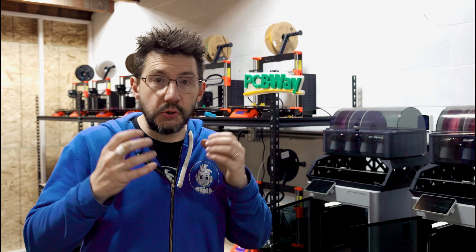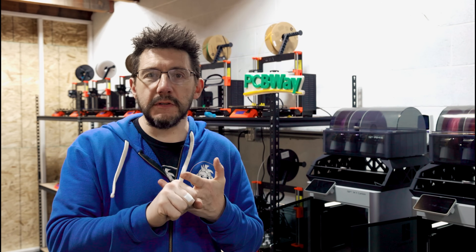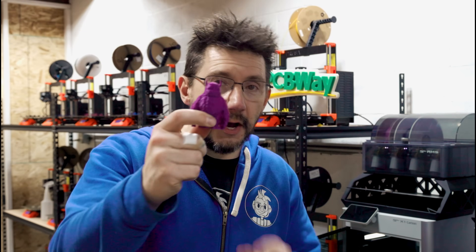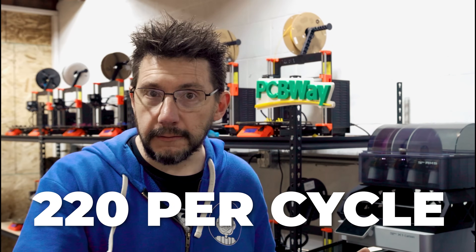We have everything we need to start the printing process. What we need to do now is clear off the 3D printers and get them ready — that means setting build plates properly, getting any support materials or purge lines off, wiping them down with isopropyl alcohol, preheating the hot end, and making sure the filament you want is in the machine. For me, I get to do that 18 times on the Prusas and then four times on the Bambu. Now that you have an agreed-upon proof of concept, go into your slicer and multiply the model on the build plate. I'm going to put 10 of these on a build plate, and with 22 machines printing, I should have 220 of these per cycle.